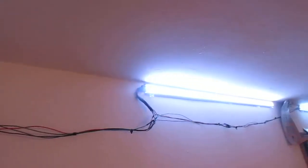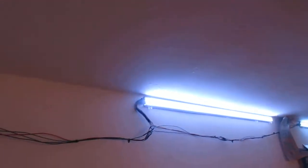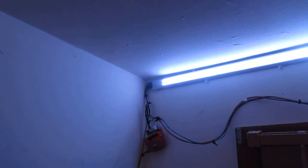It's my first Arduino project. It's not perfect — still some issues with the code, and I'm still working on some other parts of it. I'm thinking I may want to replace some of these RGB LEDs with warm white ones, because while they put out a lot of light, they don't actually look like they put out that much light, since so much color is washed out from mixing red, green, and blue without a true white to lighten up the colors.